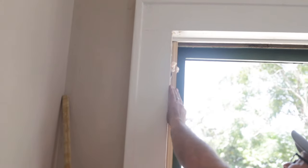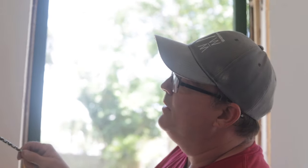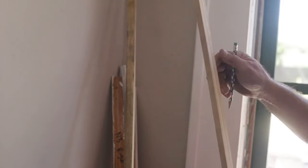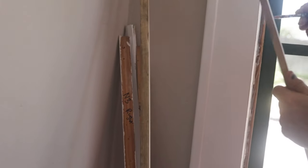It fits, but it's so tight. What I'm going to do is taper it slightly so that it goes into the hole better. I'm going to use a little tool called the block plane and just plane this one edge right there. This tool here makes it plain and simple.